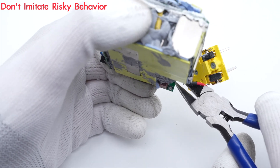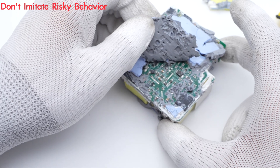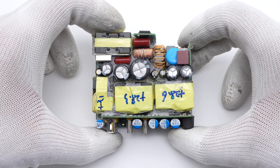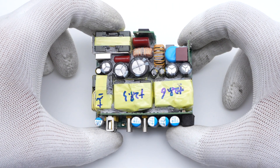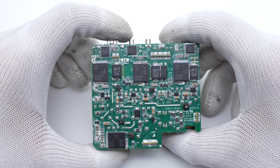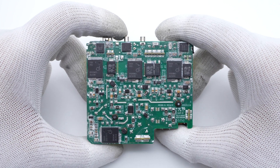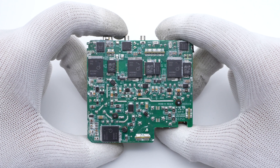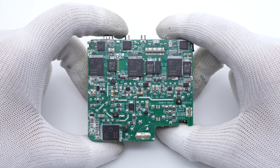After disconnecting the input wires and cleaning up the PCB, the front structure looks pretty compact. The input end is at the top, electrolytic capacitors and transformers are in the middle, and the output end is at the bottom. The circuit is composed of a PFC circuit and three independent flyback switching power supplies. It is also the first fast charger to use the Power Integrations InnoSwitch 4 Pro IC with a unique dual transformer design.